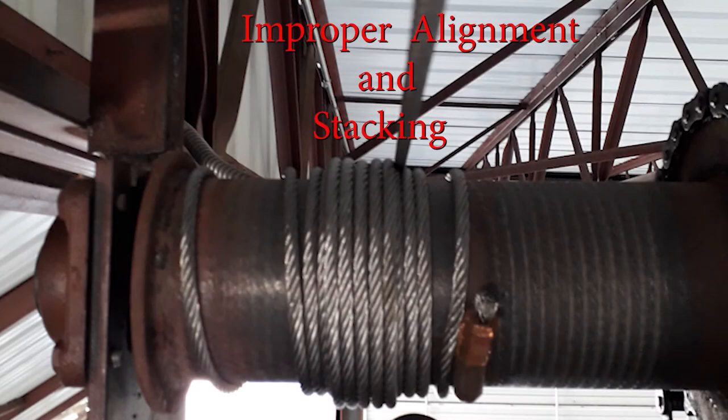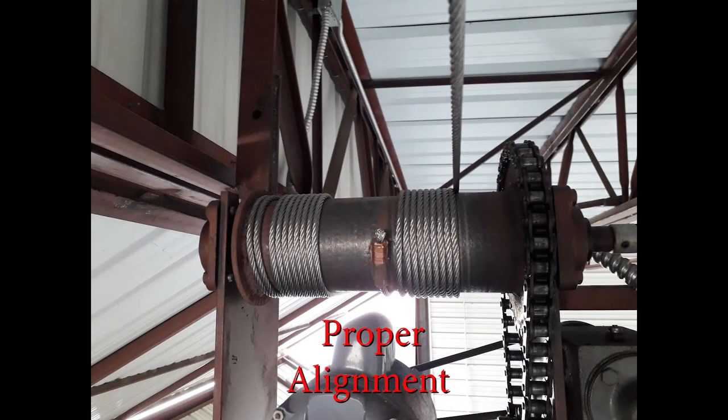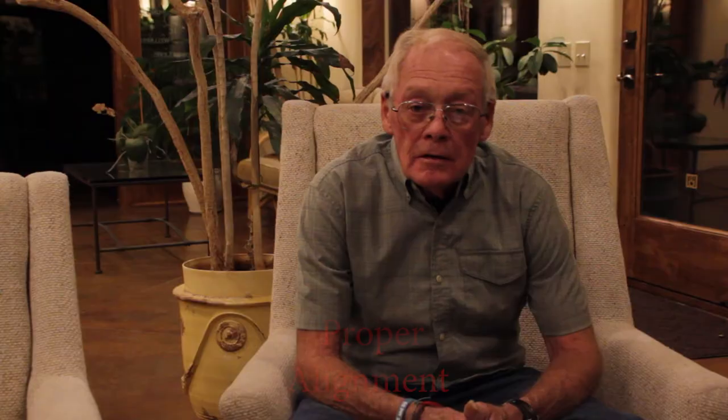We'll move into some of the issues associated with that — in particular what happens when these cables start winding in the wrong direction, stacking up on the drive spool, or in some cases actually fracture. When you do the actual cable inspection of one or however many cables seem to be too loose, it's important to note that if the cables are in okay condition there are ways to re-tension that cable.